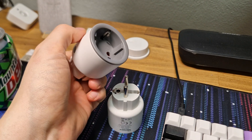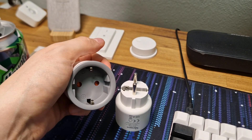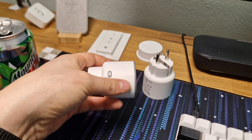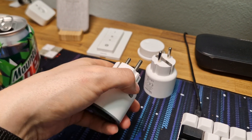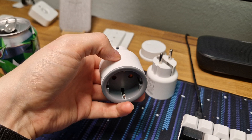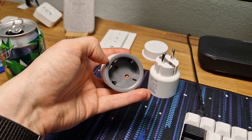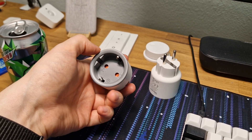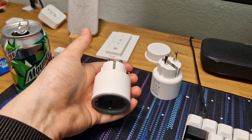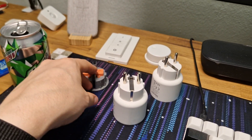I hope that someday someone can figure out a way to snoop on how Sonoff does over-the-air updates. If there's update functionality in the original firmware, you should be able to set up some sort of special Wi-Fi hotspot with a spoofed DNS server that tells it there's an update available. I'm not too optimistic that is doable, because they might do updates over SSL with a certificate required — in which case you can't do it unless they leak their certificate. The best option of course would be official support from Sonoff, which I don't think will happen.